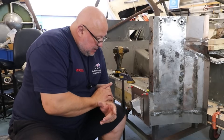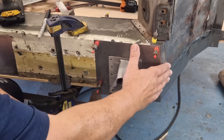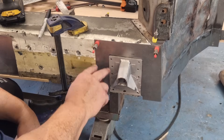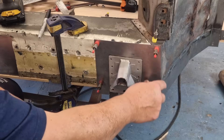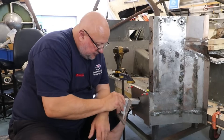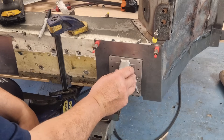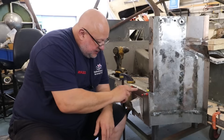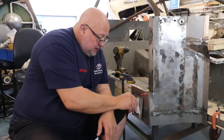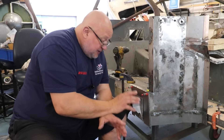Sitrep: I've made a panel there to go from where the edge needed correcting back to here. That's a good inch - more than an inch - past where the jacking point goes. So the jacking point fits through a hole in there, I've roughed that out, I've roughed the bottom away so it all clears. The jacking point goes there and that has to load last. The point is this panel here has a much, much bigger footprint than what you had before.